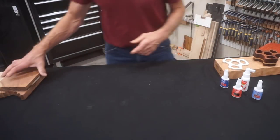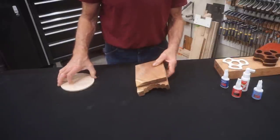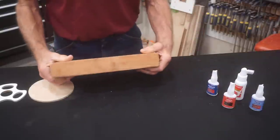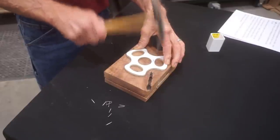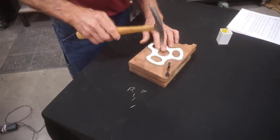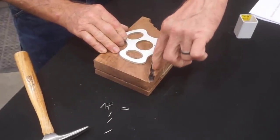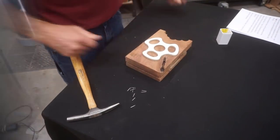For better proportions, I made the top layer of the blank one inch thick and the bottom layer a little over a half-inch thick, but a chunk of solid wood with nice grain works just as well. The first step for making the caddy is to attach the template to the blank. I don't trust double-stick tape on a template like this, so I used two number 18 by 5/8-inch long nails placed strategically on center lines to do the job — that way the template is fastened securely with no chance of movement.